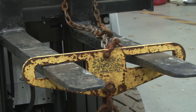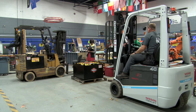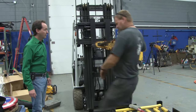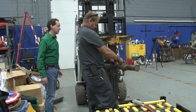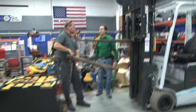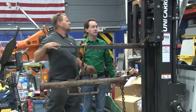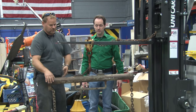So this is basically your little crane adapter for your forklift — it's a little adapter plate. We've been looking to get one of the slide-on boom crane adapters. The thing is, anything you put on here lessens your forklift's ability to lift — a lot — because you're hanging way out. Even these size attachments take away from the overall weight and capacity, because that has weight. Everything takes away from the capacity.